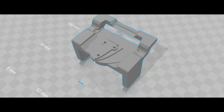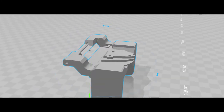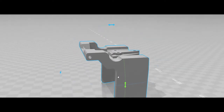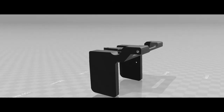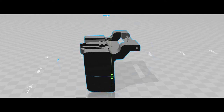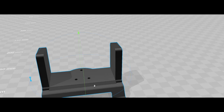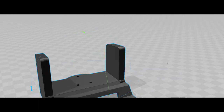This is the back of the diff housing where the actual input shaft is. These little ridges and steps are things I had to do to make sure there was clearance for everything. Got all this gutted out here so that the upper link can move up and down. So the servo mount is going to sit basically right here, it's just going to extend back so the servo will hang over a bit — probably half the servo is hanging off. I'm going to extend here and down as well, so this is going to become bigger. I can't put a plate here because that'll get in the way of the steering, so that'll be knocked out next. I've got it started in another file but it isn't presentable right now.